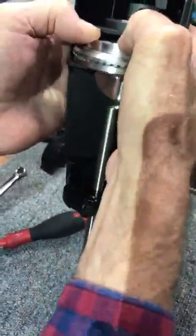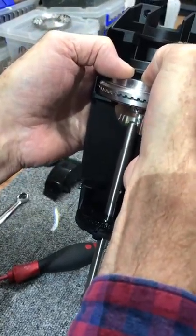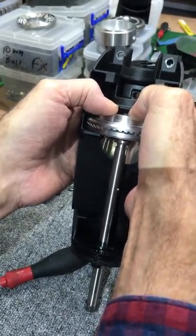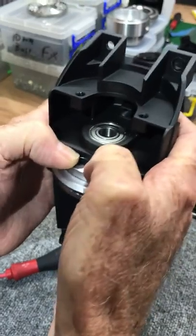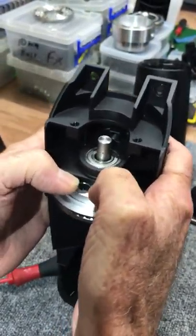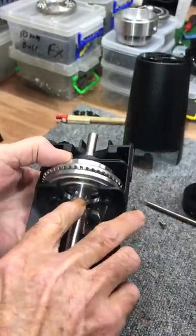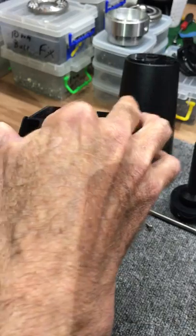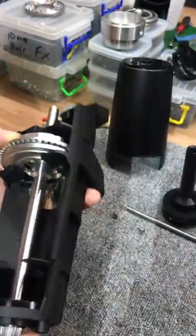So, I have aligned the teeth of this burr with my thumbs, and I'm holding it in this direction. The end of the axle enters. Now you have to be kind of careful. Just kind of jiggle it, and it will drop. Jiggle it and bump it to the axle. It has to go through this little part of the carrier, and it's a very tight tolerance. This is aluminum, this is stainless steel. You don't want to damage the edge of that carrier, so be kind of careful here. Let me show you that again.